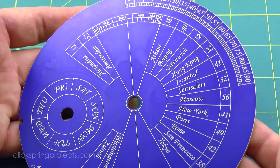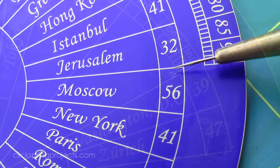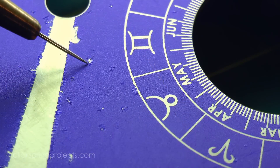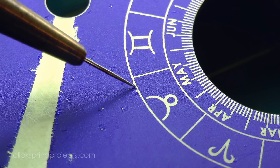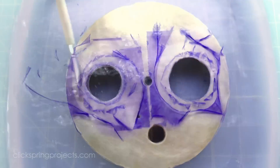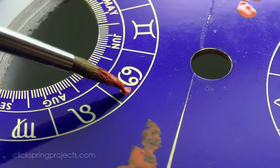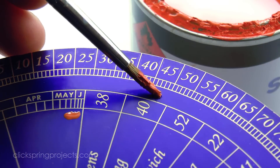Once flushed with water, the exposure can be examined for flaws, and it's quite common to have at least a few. Providing they're in areas that are clear of the artwork detail, they can be addressed with paint and carefully patched over. But if the flaw is a little more significant, like something like this, then it's a sure sign that something went wrong during the cleaning or film application stages — the resist hasn't bonded properly to the metal, and the only option is to strip the workpiece and start again. But if the exposure otherwise looks good, then the small errors can be patched, and the larger areas that won't be etched can also be masked off. If it's a convenient flat surface, a clear tape will often do the job.